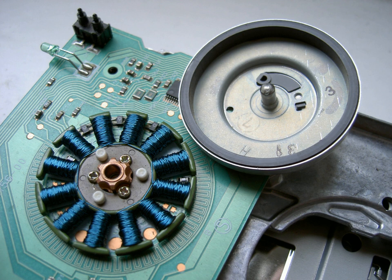The application of brushless DC motors within industrial engineering primarily focuses on manufacturing engineering or industrial automation design. In manufacturing, brushless motors are primarily used for motion control, positioning, or actuation systems. Brushless motors are ideally suited for manufacturing applications because of their high power density, good speed-torque characteristics, high efficiency, wide speed ranges, and low maintenance. The most common uses of brushless DC motors in industrial engineering are linear motors, servomotors, actuators for industrial robots, extruder drive motors, and feed drives for CNC machine tools.